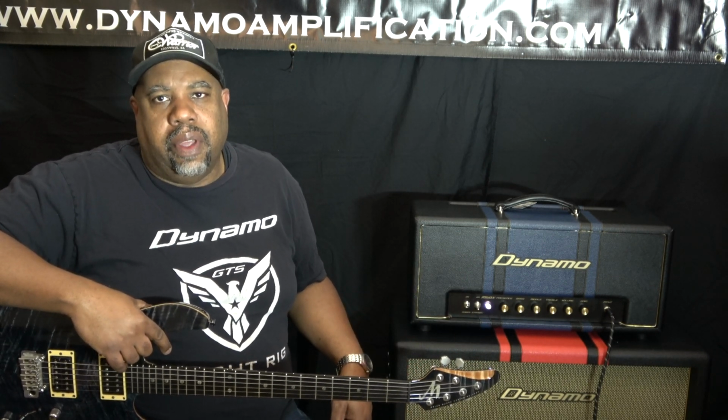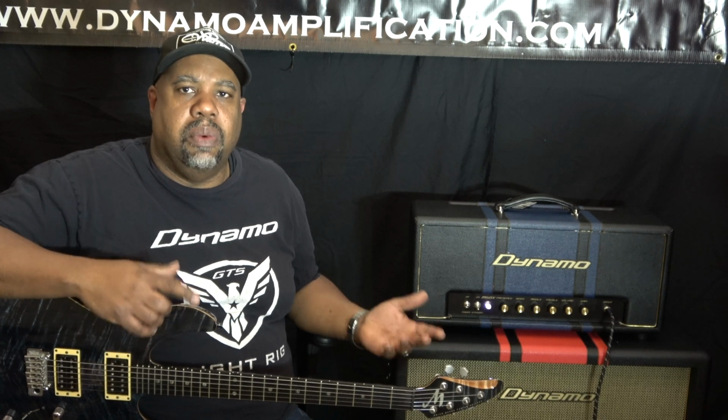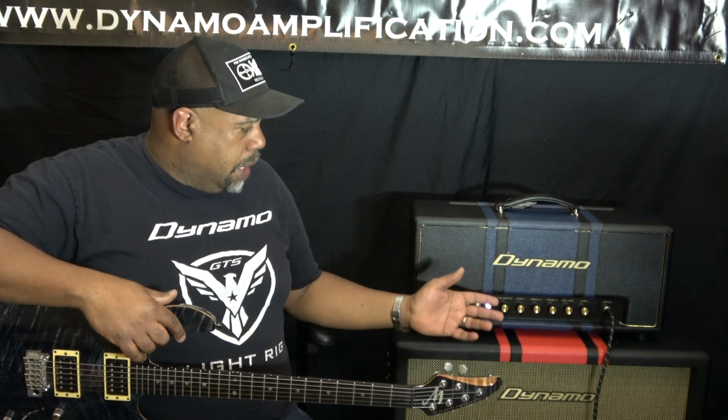Then I asked the customer, do you want me to leave it like the GTS style, or do you want me to turn it back to the M50X style? Which one do you want? But anyway, I decided to do a video showing it in its current form, which pretty much has the GTS mod. I changed some of the values and some of the structures on the stages to match the GTS amps.